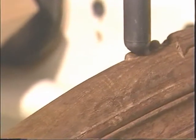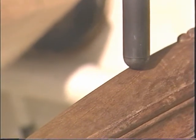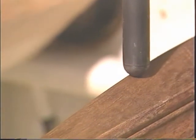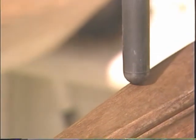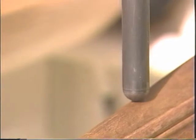The initial surface scan is an automatic process that uses a ball-nose probe tip and cutter that travel the entire length of the part, shift over, and return until the entire surface has been scanned. This can be run overnight to minimize production disruptions.